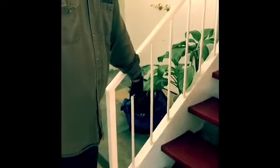Right. Okay. And then another safety feature, which I mentioned before, so the gap between the railing here, this should not be more than 4 inches. This here is about 5 or so, closer to 5 or 6. So a small child or small adult, if they're not careful, or an animal can stick their head and get it stuck. I've seen this happen before. It's no fun, and it's a legitimate safety concern.